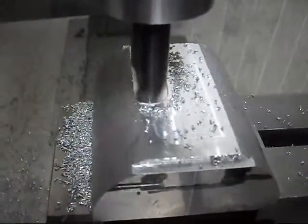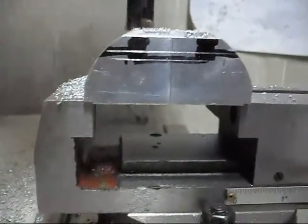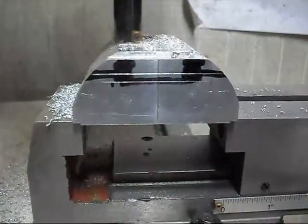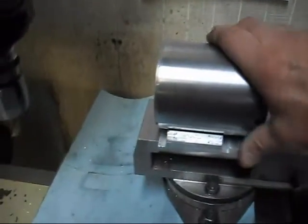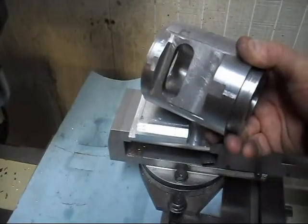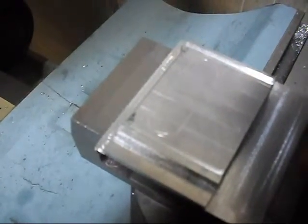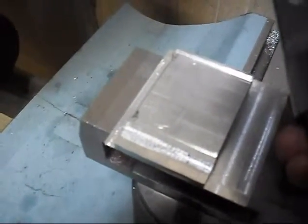In this section you can see there are some scribe marks on the piece of aluminum we've got in the vise — we're just machining here to get things rough cut to size. On to the bearing carrier: I had to machine that all out, with a big slot there. I've got it marked on here and I've got to machine some of that out, then put four mounting holes in there before I take it out of the vise.